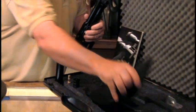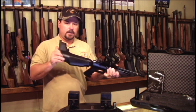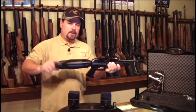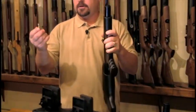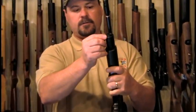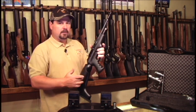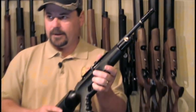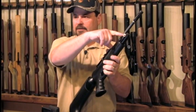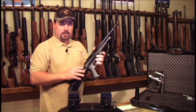When filling your FX Verminator with either the pistol tank or the rifle tank attached, you simply take the FX probe that is supplied with the gun, slide it into the front, and it enables you to fill the tank. Both the front and the rear tank are filled. When you remove the rear tank to apply the pistol tank, you will lose the air capacity in the front, so at that point you will have to refill after you put the pistol tank on.